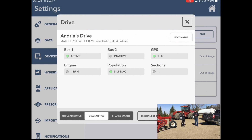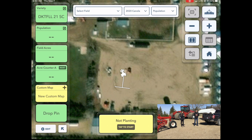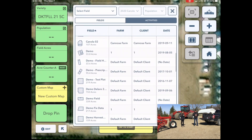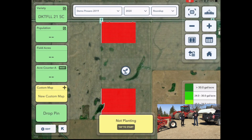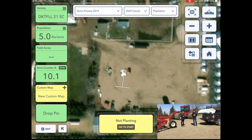Once it's connected, tap on the Edit button, go down to the Diagnostics section, and make sure GPS is getting a signal — whether you're tapped into your Case GPS, your John Deere, or whatever the case may be. If you have one hertz, you should be able to map. It looks like we're good to go. Now, to start mapping: go to the map screen on the iPad, select any field — the field you're going to today — make it active, select a hybrid, select a rate, and confirm. You can see the tractors are in the field and ready to go. You'll see that 'Not Planting — Tap to Start' button, which you'll tap when you want to start mapping.